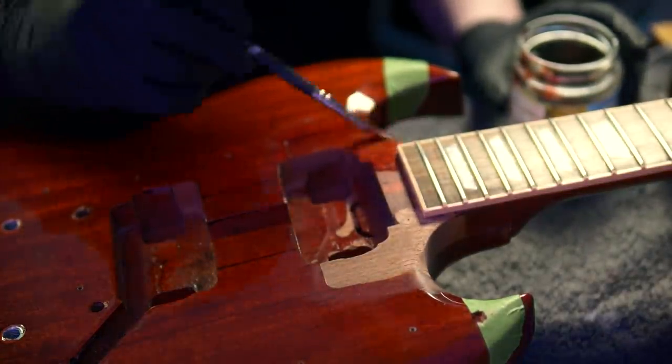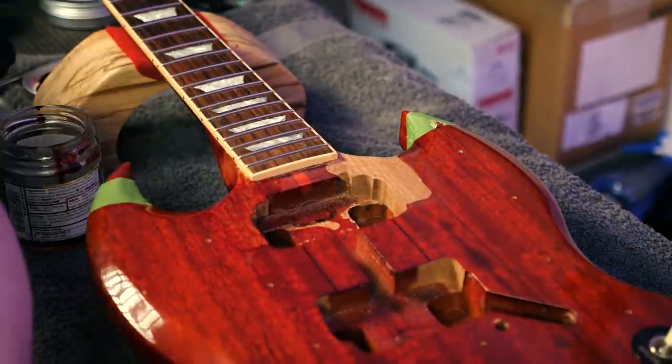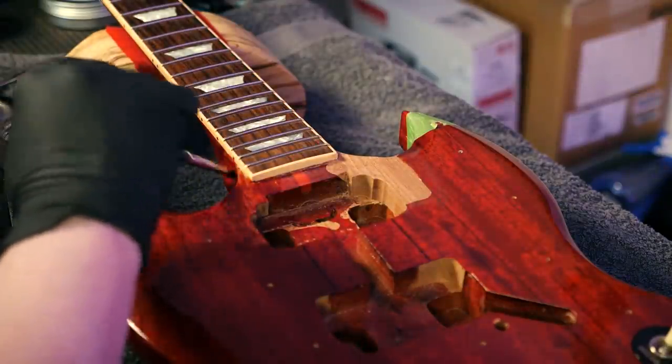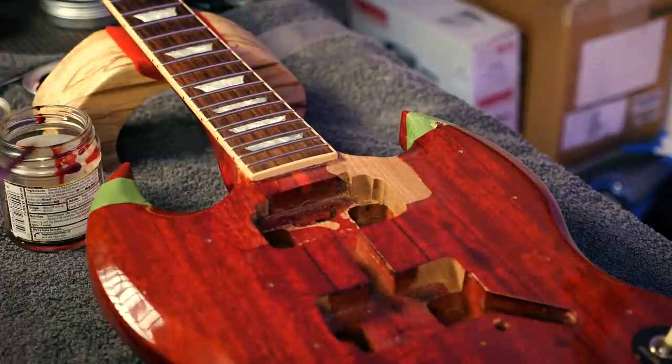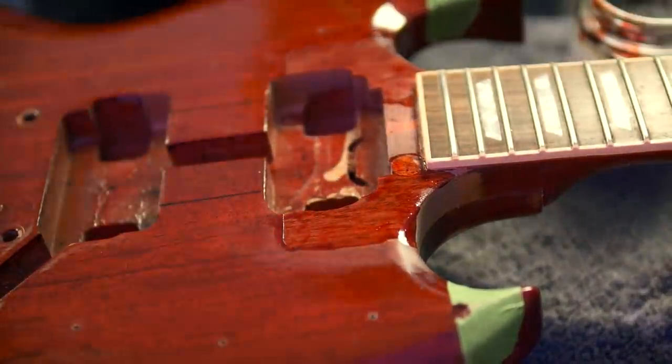Two, the colour is all dependent on how thinned the finish was when being applied originally, something I have no real way of knowing, and since this is a transparent finish, the underlying wood is going to influence the colour tonality. The mahogany I've repaired with is a duller, browner colour than the brighter, more orange wood the guitar was built from, so this will affect the result.